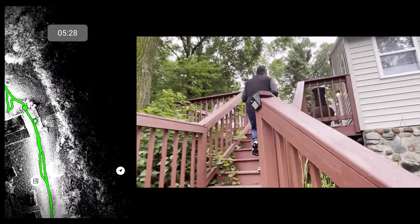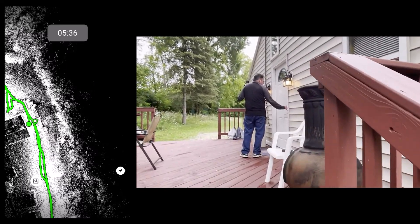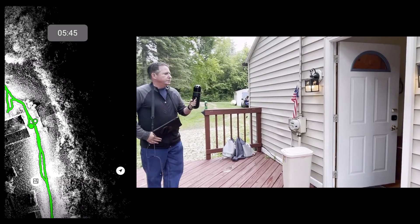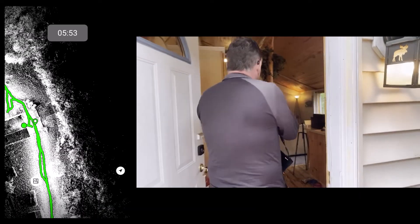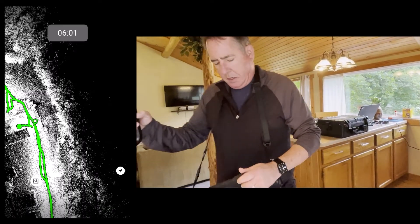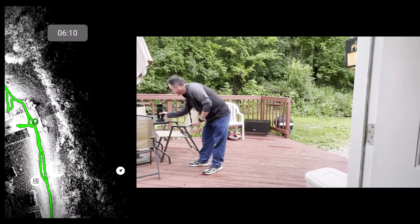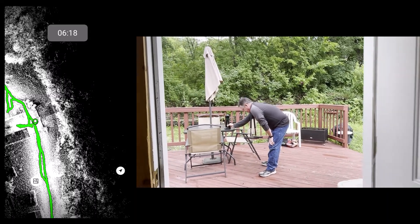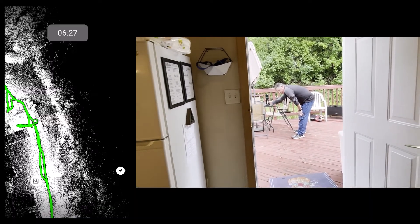As I approach the starting point again, I have a couple of things to keep in mind. I'm going to use two separate walks to do this project — the first outside and the second inside. I need to have overlap between the two walks so that the software can match them together using cloud-to-cloud registration. To do this, I will let the unit scan part of the main first floor living area and then go back to the base and end the walk. Now I'm walking back to the base, setting the unit back on the base, and watching the tablet to make sure that my path is going right back to the original space — another quality assurance check.